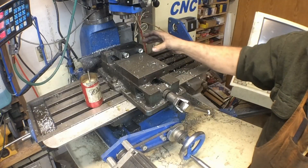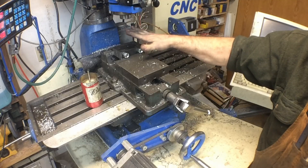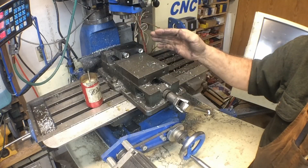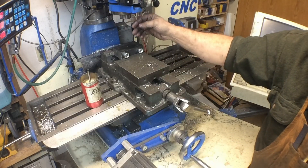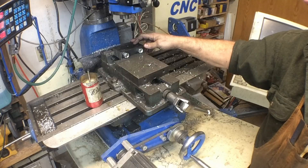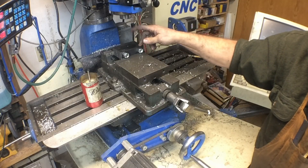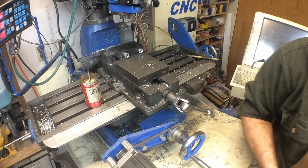What I've done is clamped the two halves together and gone to a longer set of parallels underneath, with a bolt in place. We already had our left-right position because we already had a stop set up, and I just moved to the center with a spot drill — just visually dropped it in there, it's not that critical. I'm going to go ahead and drill it out as close as I can get it, then set up a boring head. I may have a clearance issue with the boring head — we'll see if my small boring head will fit in there.